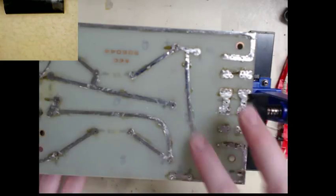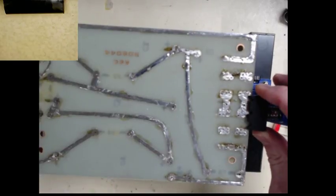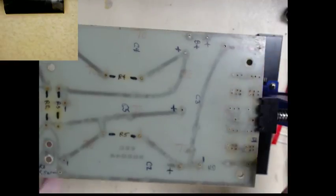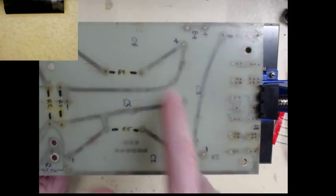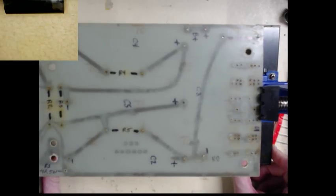and the original circuit board didn't have any type of tinning on it, so I got that all cleaned up and did a manual tin with some solder. We'll talk some more about that in a minute. After I took off all the parts, I just marked where the different capacitors go, the diodes go, and then the balancing resistors and so forth. I don't have the 4-ohm 5-watt resistor for the meter. I can get that later.